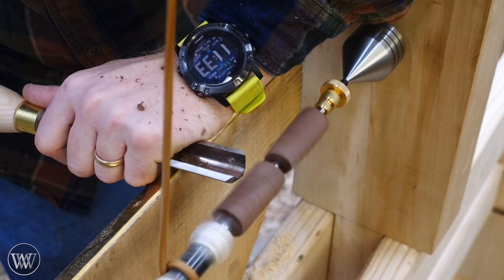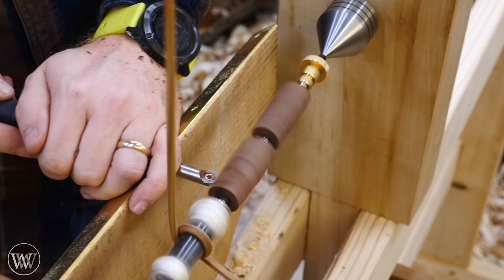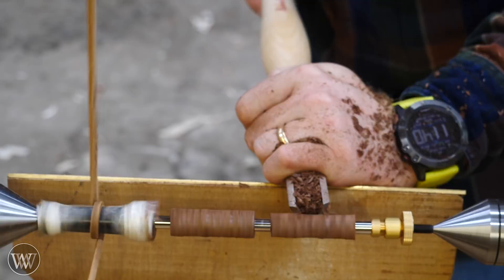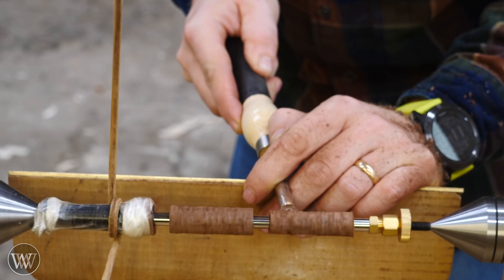I was playing with a couple different bits, trying different things, bringing it down and experimenting. I also tried a pin kit from Rockler with the carbide heads — I used to love carbide heads when I was turning, they're just so much fun, faster and easier. But for this I just wasn't happy with them. I went back to the roughing gouge for most of the roughing and got them into a pretty close-to-round shape. I tried the carbide head again, but again I wasn't as happy — they were slower, more of a scraping, and with the slow RPMs on this they just weren't as efficient. Not to mention they left a rougher surface. So let's work with the traditional ones.